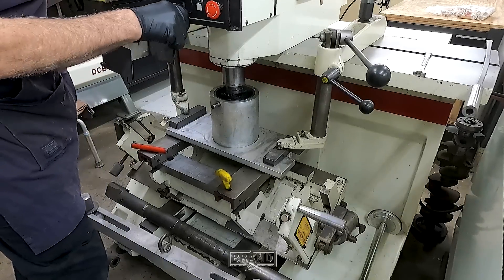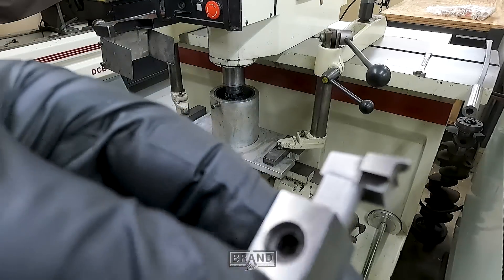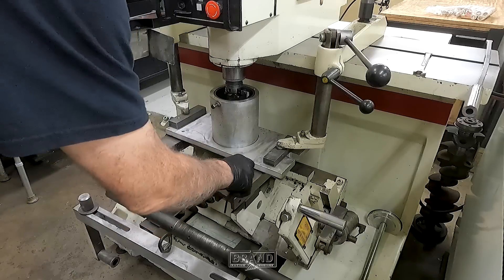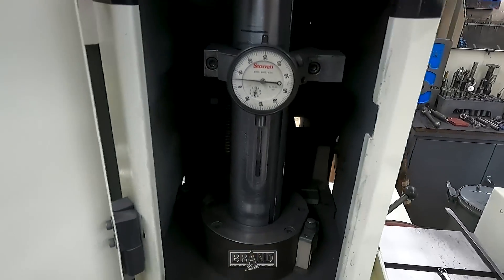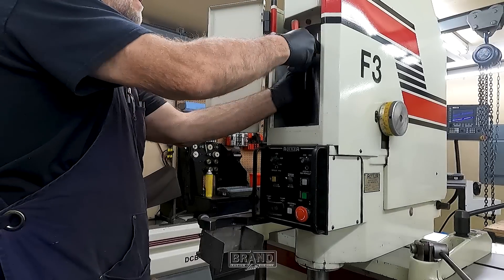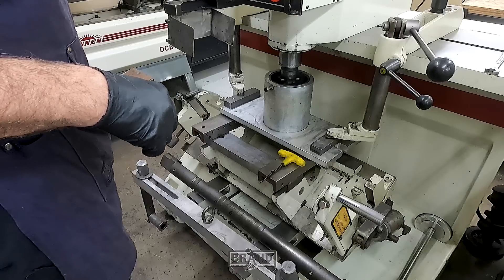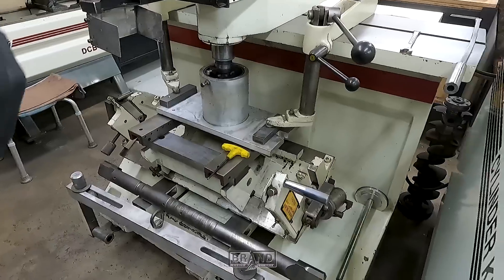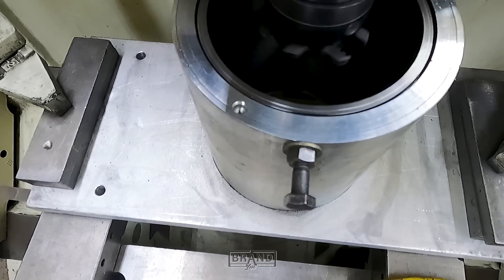Use the expansion fingers to center it, lock it down. I have this o-ring tool that we'll cut the groove with. Got this dial indicator up here in the top — let me move the camera so you can see. I'll drop it down, indicator's touching. Close the seat down pretty slow, go down until you touch off.